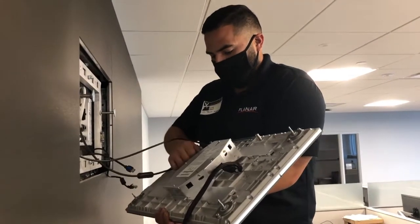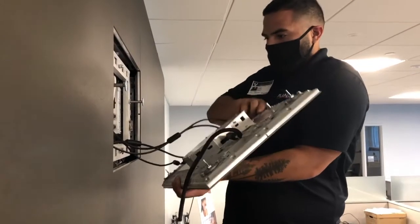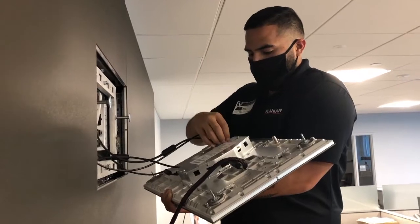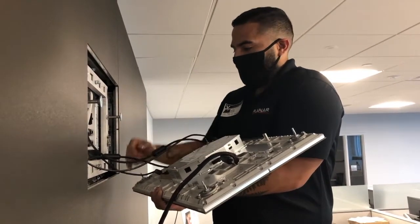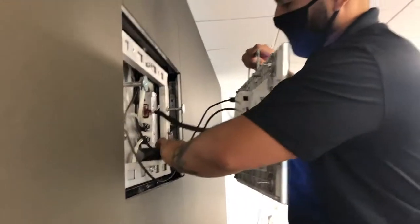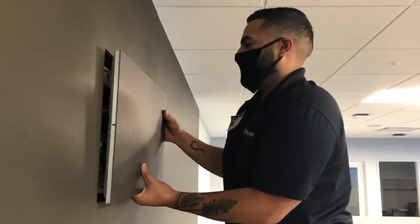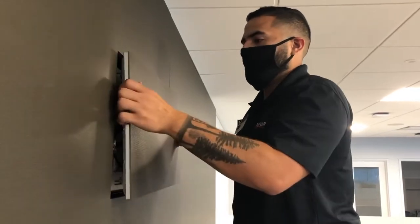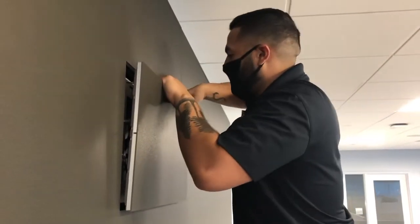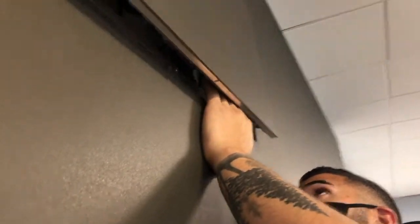So that was the control cable you plugged in — control and HDMI. Just to explain how these cables are daisy-chained: it's feeding from the bottom panel all the way up. The top output feeds to the top panel, and the bottom inputs are coming in from the panel below it. Always plug in the control and HDMI before plugging in the power. The reason is the power cable is a lot shorter than the other cables — if you plug in the short cable first, it makes things harder. Be very careful when setting the cabinet because you don't want it to touch any other modules already on the wall. Get your cables out of the way — you don't want to be pinching any cables.